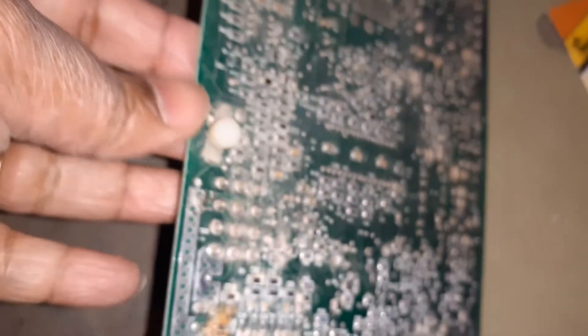Your board probably doesn't come with these clips, but they are very important. Use needle-nose pliers, squeeze in, and they will come out. There were four of these clips that hold the board away from the metal back — so you don't want it to touch. Make sure those are installed.